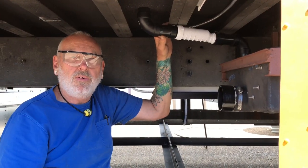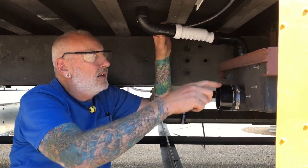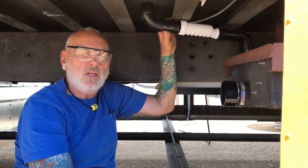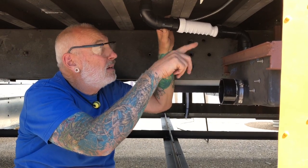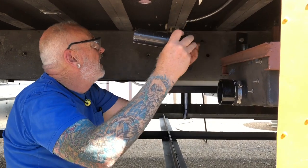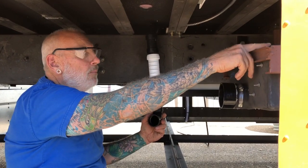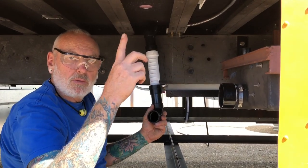I've confirmed that this is the height the tank is going to stay at. We know where we want to put the vent up in the pantry area, so we can drill the probing holes down through there and locate where that vent is going to be. I have enough space to get that pipe across, and once I put the vent hole on the back I can run across to the other one - I only have to have one vent pipe going up through the roof.